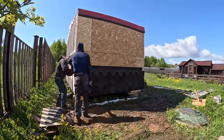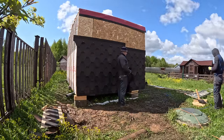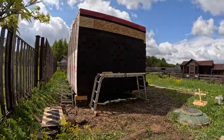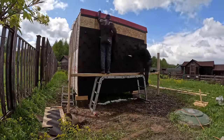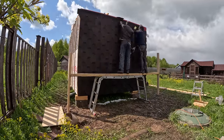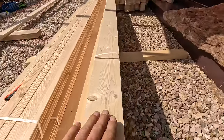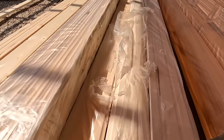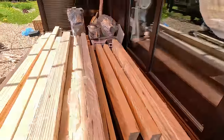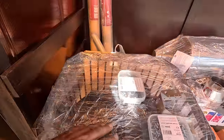The flexible shingle is really inexpensive — even in money terms, OSB plus shingles is about 600 rubles per square meter if you do it yourself. You could probably just paint the OSB with some kind of paint and it would last a long time, but here I just did it and forgot. Once we started finishing the exterior, I allocated the materials: the sides and front will be imitation timber cladding, the inside will be linden lining — that's the banya area — and the changing room will be pine wagon lining, also dry planed 30mm boards on the walls. I also allocated everything for the interior. We have 100mm mineral wool in the walls.